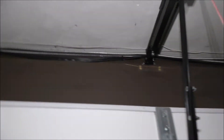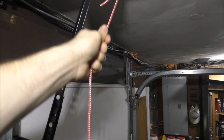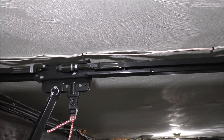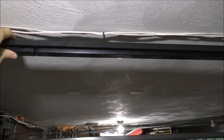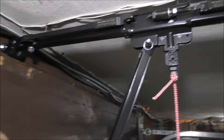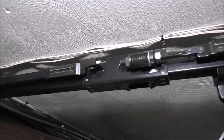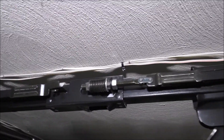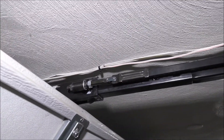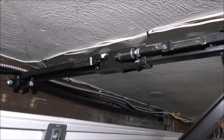This door does the exact same thing the other door does. When there's no power, here's your motor-shaft release — you pull this down, watch the track. See how much tension it has — I don't know if that's too tight or not. The problem is right over here where the mechanism is: when this door goes up it basically gets stuck. See, there's the lift door, and when I fully lift it up, it gets stuck.